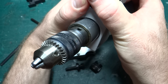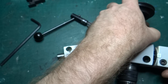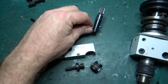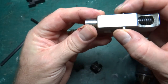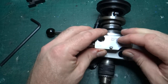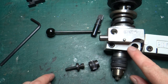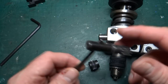The teeth go into the grooves on the back of the quill — you can just see them there. So as you turn the handle it moves the quill up and down as it bites in and out of the grooves. That's how it goes up and down. So what we want is a way of rotating this by finer increments. This piece has a little bar protruding through it, and this slots into a tiny little dimple on the side of the head. It's quite a tight fit the first time because the paint had gotten into the hole a little, but once I'd done it once it fits nicely.